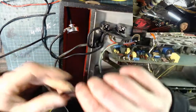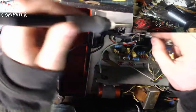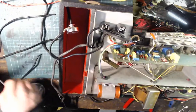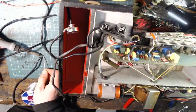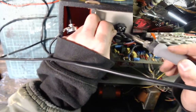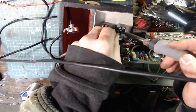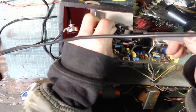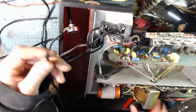Okay, so the inside of this cable, I'm going to solder to this. From the outside, I'm going to solder to the ground as well, so it's shielded. So when it's going over the power lines in here, hopefully there's not going to be any noisy problems. Oh, you bumhead. Boom. So this is shielded up to the end.